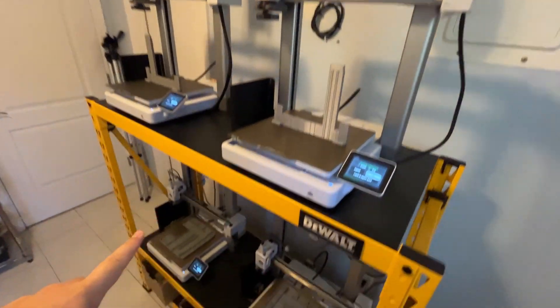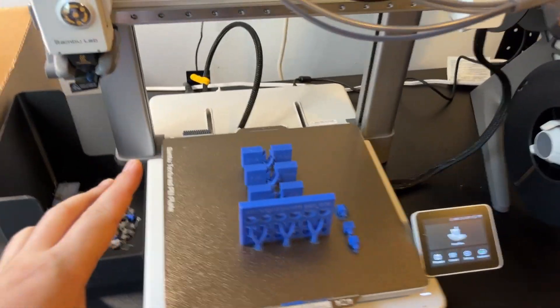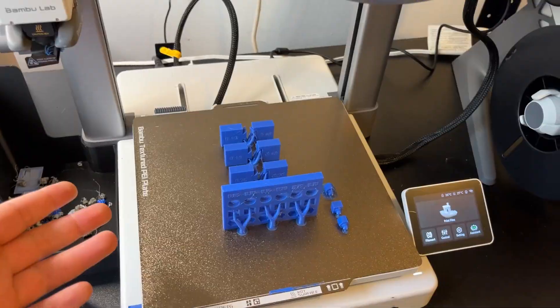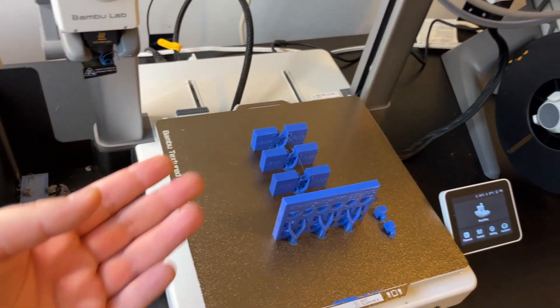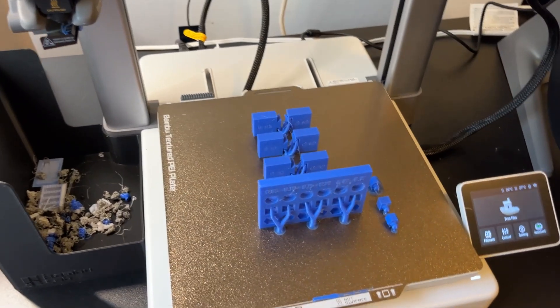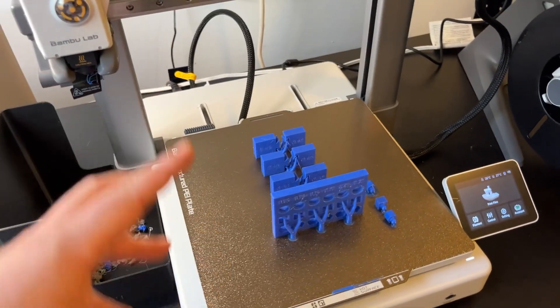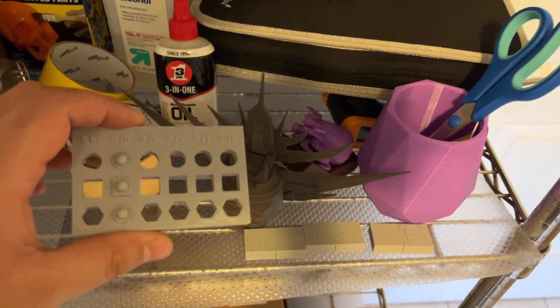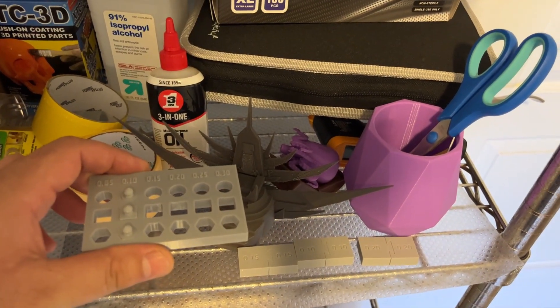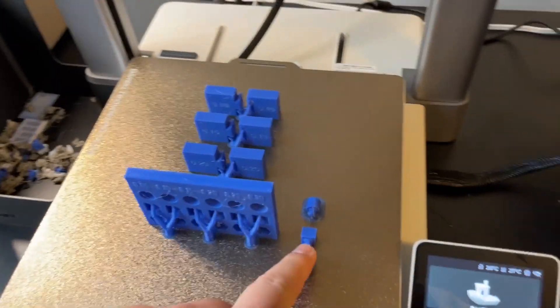For the AMS light combo I use all the near-empty spools of filament that I can't use to make one full product on these machines. Now over here we've got another tolerance test, and as you can see it's upright. Shout out to Jay Hautz — he mentioned to do it upright to test the Z-plane tolerance, so thank you for that suggestion. We have the one from yesterday where I did it flat, testing X and Y, same with these here, and I also printed out these bits sideways.